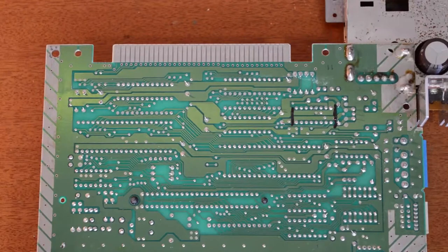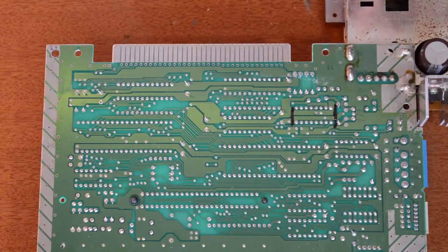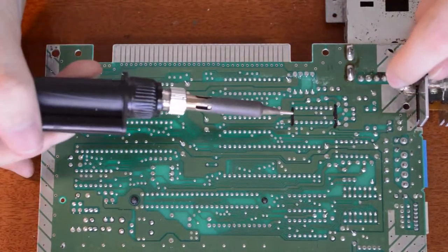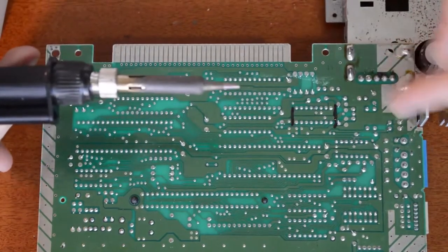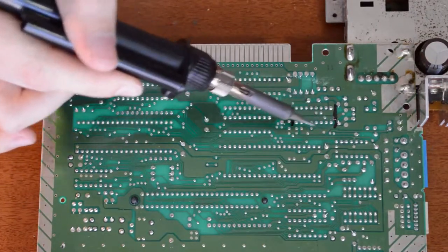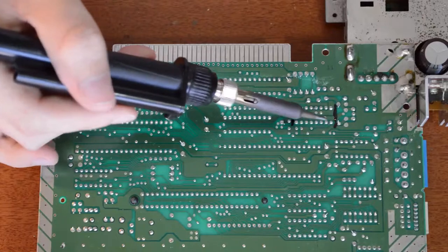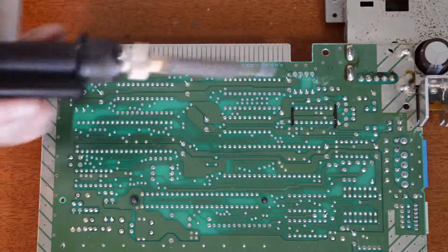I've just used a Sharpie to color each side of the chip to make it easier to see. We're going to need to heat up all these pins — 1, 2, 3, 4, 5, 6, however many there are. There are a few different ways to do this. You can do it by hand with an iron, cleaning up each pin at a time, which is probably the easiest way and puts the least thermal stress on the IC. The other way is to use a hot air gun and heat up the entire area at once, then pull the entire chip out from the bottom. I recommend doing it first with the iron, especially on the finer points which aren't connected to large ground planes, and then if it's stuck you can use hot air to clean it up.